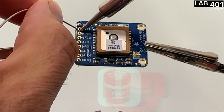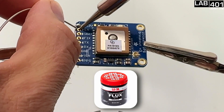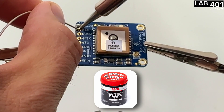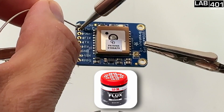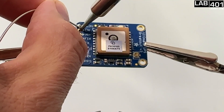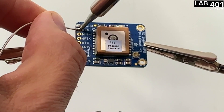The one thing I didn't have was soldering flux. I highly recommend using soldering flux on all the connections that you're going to be soldering to — it will clean the oils off and make it easier to stick. I had to raise my heat up on my soldering iron. A good temperature for electronics is probably around 650 degrees. I brought it up to about 700 and it still took me a little longer than I'd like.